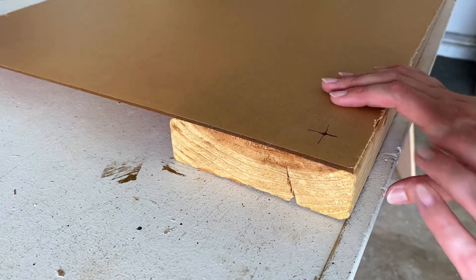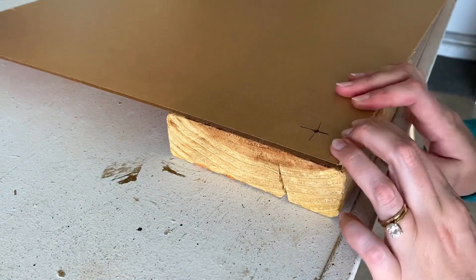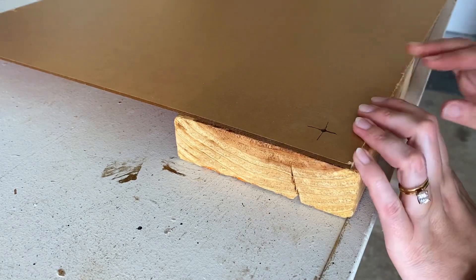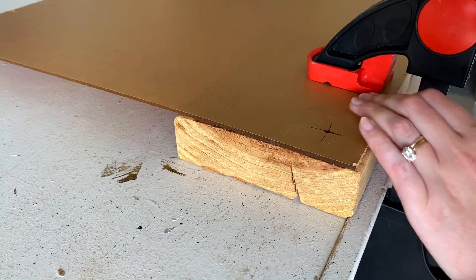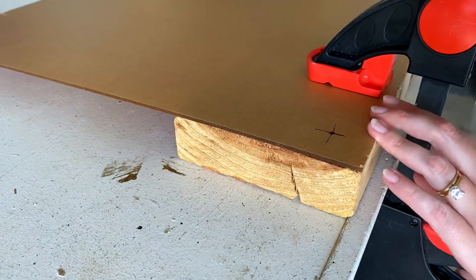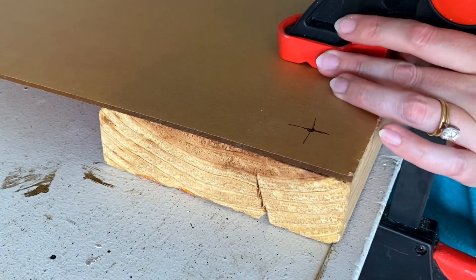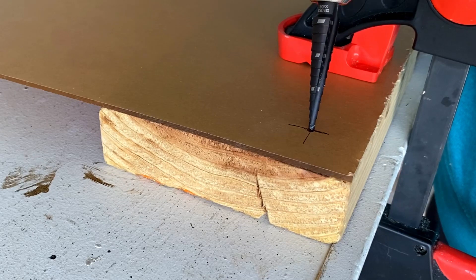When you're working with the acrylic pieces, you are going to want the entire area underneath around where you are drilling onto a hard surface that you can drill into. This will help with the blowout and obviously protect your work surface. I'm just clamping that down so it is pretty sturdy. I usually start kind of slow, and then as I work my way down I will speed it up a little bit and put it right on that hash mark there.